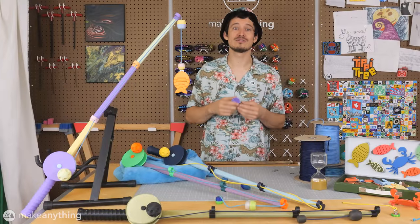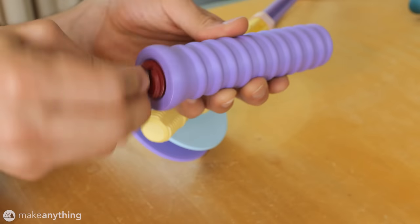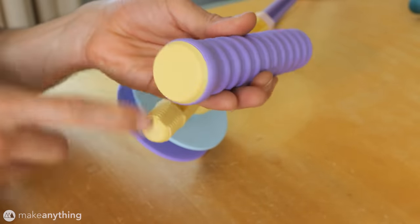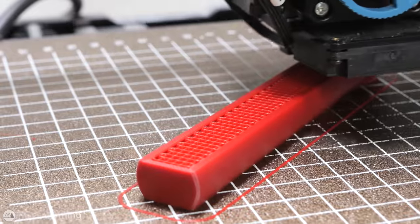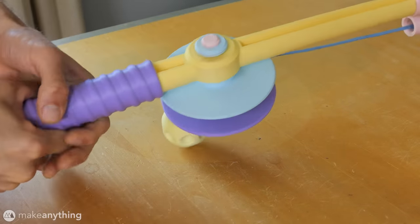but for the sake of providing a really robust solution, I designed a second version that has a hollow core, and that houses an insert which is printed laying down and threaded into place. And this end cap just hides the bottom. The layer orientation of that core lends itself to a much stronger part. Plus, we get to keep the nice matte look of this Polyterra filament.